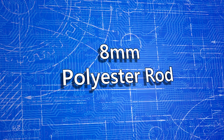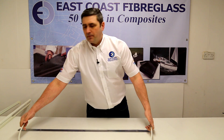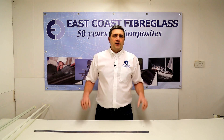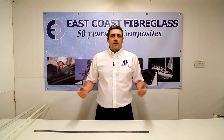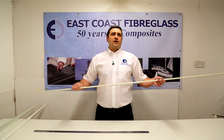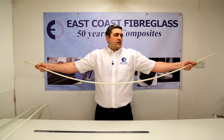Next in the range of tubes is the white 8mm diameter tube with a 5mm inside diameter. That one will comfortably bend to a metre wide diameter on a curve. We have two more in the range but they've become a bit more rigid because of the diameter, so I'm not going to try and bend these ones — they'll be more for applications where you need a bit more support over a long length. The next one up is the 12.7mm with the 8.5mm inside diameter. As you can see it's quite rigid — there is a little bit of give in flexibility, but not really enough to create a loop that I can actually demonstrate in the video.